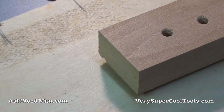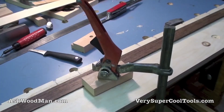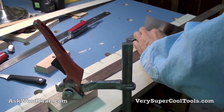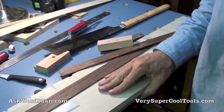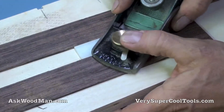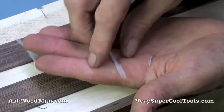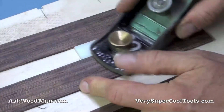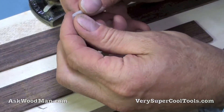That looks really good. I'm going to put a clamp on this while I'm getting the rest of my setup going, just to make sure I pull this nice and flat before I cut on it. I'm going to use this piece of wenge — I'll just cut a little section off so I can have two pieces to work with. Now I've got this in here, and I can feel that's about a thirty-second lower. Here's my block plane. I can come in here and know I'm not going to cut beyond that wenge. Look how beautiful this cuts — that's just a perfect shaving.